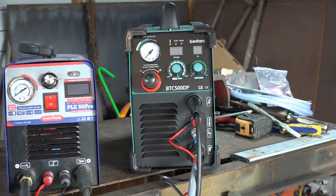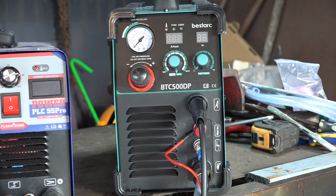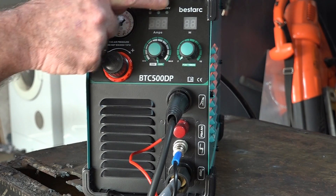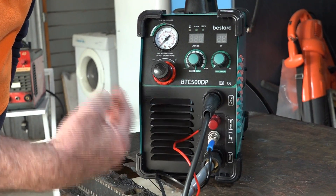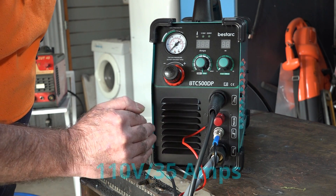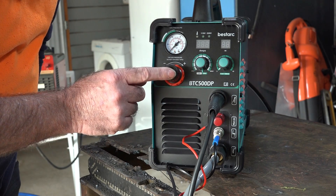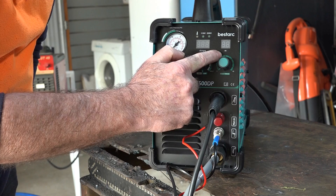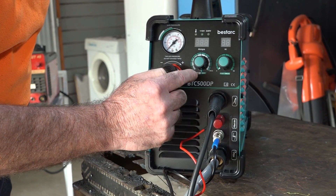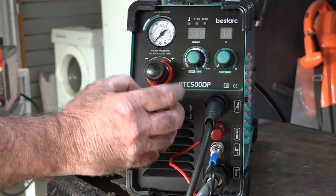Now for the best of the three — the Best Arc 50-amp machine. It has more adjustments than the other two because it's multi-voltage: it automatically detects 110 volt and 220 volt, and you just plug it into your wall outlet. On 110 volts you'll only get 35 amps; on 220 volts you get the full 50 amps. It also has an air adjustment on the front and a digital readout for post time, which is far more accurate — especially useful if you're on a small compressor or want to avoid tripping circuit breakers on 110 volt.